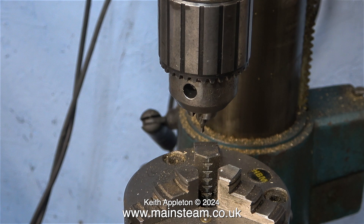I'm going to be using a center drill, and I use this center drill to align the rotary table with the center of the main machine spindle. This is very important.